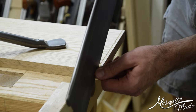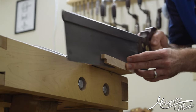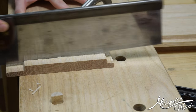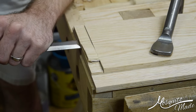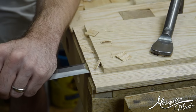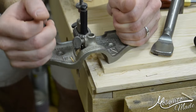After that, I trimmed things down to the actual sizes they needed to be. When I cut them on the table saw I basically just cut off those miters I didn't need anymore and now I'm cutting things to actual size. Here I'm making a rabbet across the end — I cut the end grain and then came in with a chisel to rough it out, followed up with the router plane to make it a nice even depth to match the other rabbets.